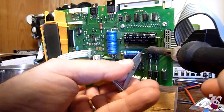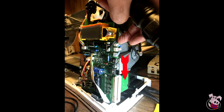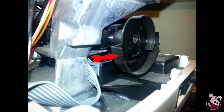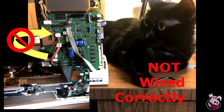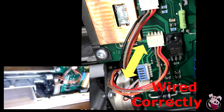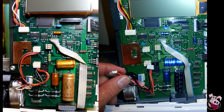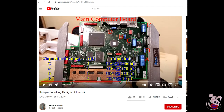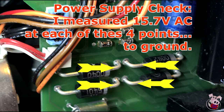Let's go over some symptoms or problems you might encounter. If the speed is slow and the machine is not accelerating when you push the pedal, remember the speed controller daughter board we removed — make sure it's on straight and the little wheel is going through the sensor properly. If the needle is offset, not centering properly, or when you press the pedal the fabric is pushing backward, those motor connections are probably backwards. It's not uncommon that parts made at the same time can have similar failure rates. When I opened the second unit and saw all the capacitors were a totally different color with different production marks, that ruled out a batch failure. Looking at Hector's video, he clearly has a model that's 10 years newer, and though the capacitors look to be from the same manufacturer, he's having similar problems — so is this really just a capacitor problem or an attribute of their design?